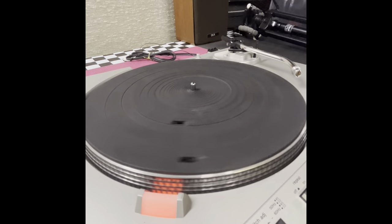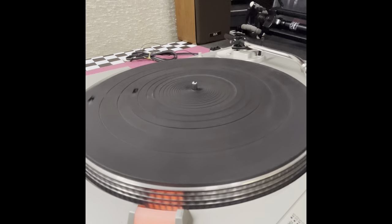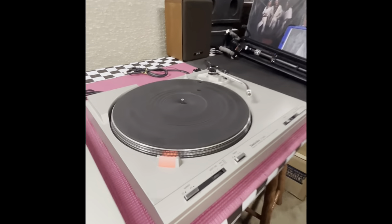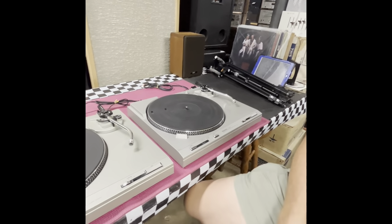You should be able to pick up and hear the clicking noise made by the motor. The internet suggests that this is a point of impending doom for the motor — it's really not. It's a plastic piece inside the motor that is deteriorating and becoming loose and rubbing on the casing. I'm going to demonstrate in this video how to repair that motor and clean up the inside of the casing so that the piece doesn't rub anymore.